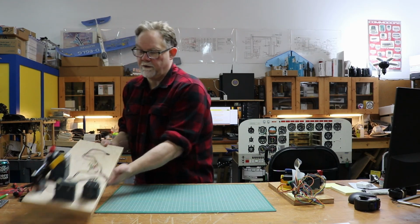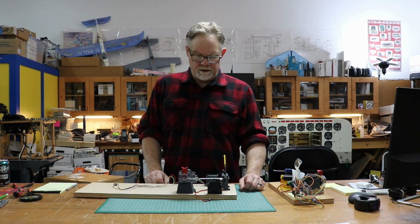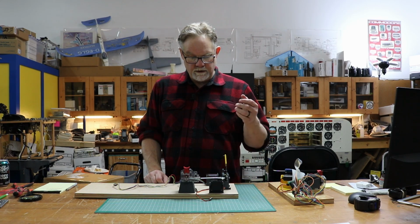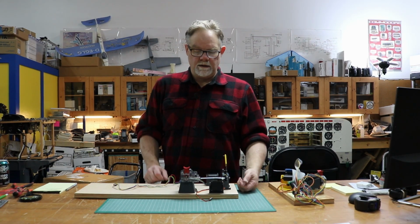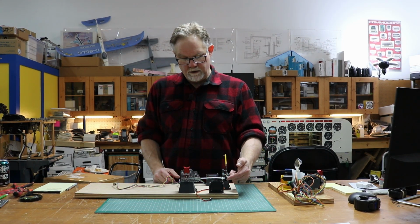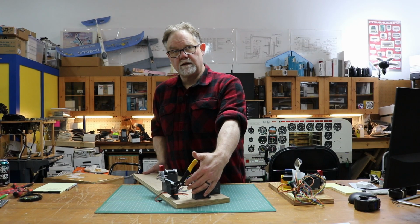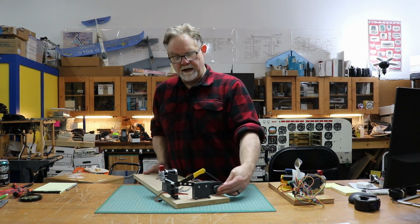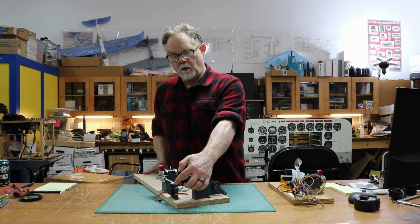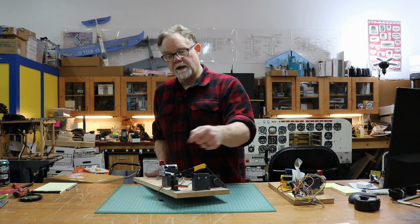This is the other version that I came up with. This is based on some other designs that I have seen on the internet, where this one strips and cuts. Same drive. I've got a servo that will move the tip of the wire into the cutters. I'm using an adjustable stripper, so when it comes down, it'll cut the wire, but this will prevent it from cutting the wire when it's lined up with the stripping point on the cutters.